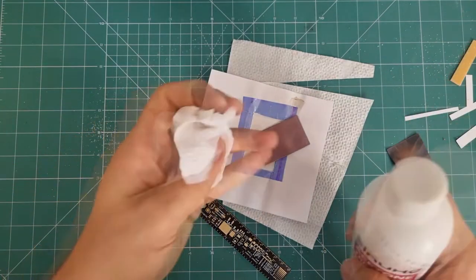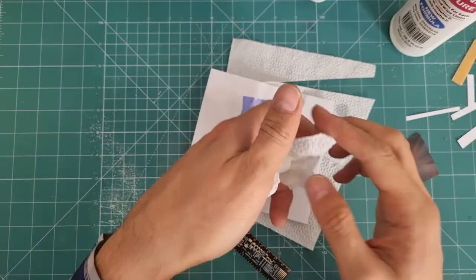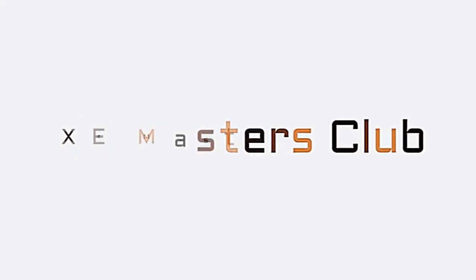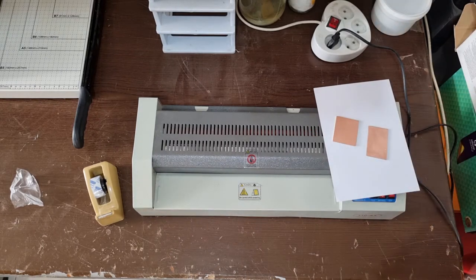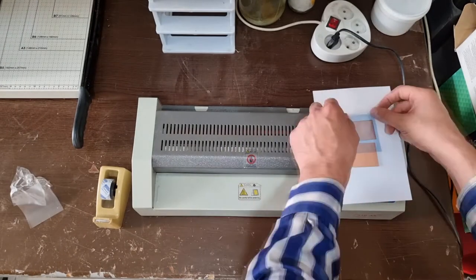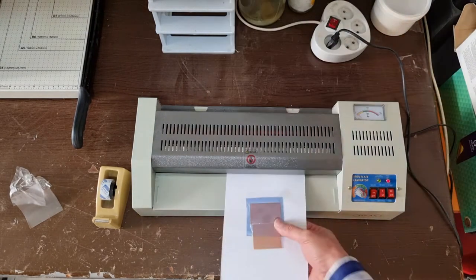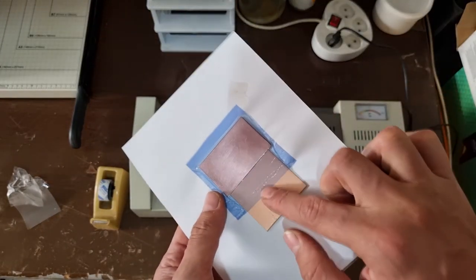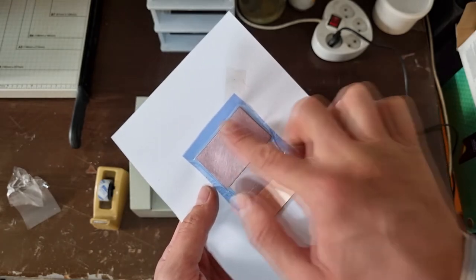With help of tissue napkin and acetone, the old dry film can be easily removed. I use another piece of copper clad board to protect main copper clad board from roughnesses. I have to repeat whole lamination process again, and then it is ready to continue the main process. It's okay, roughness is become unprotected copper clad board and main copper clad board is perfect.